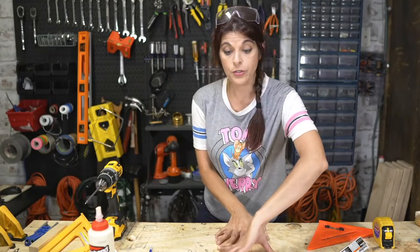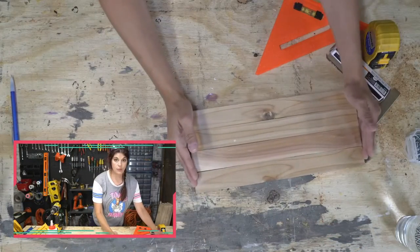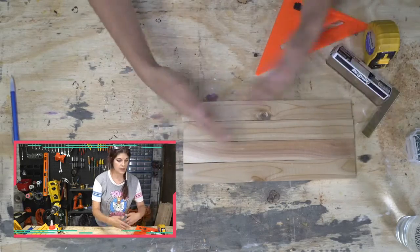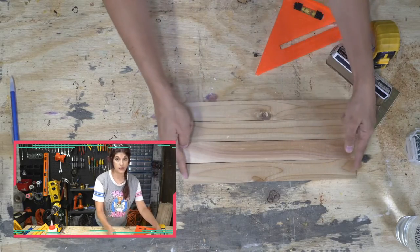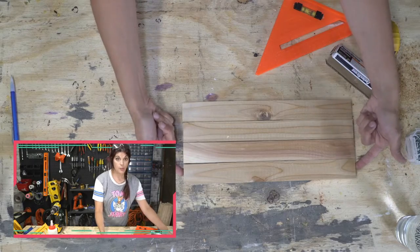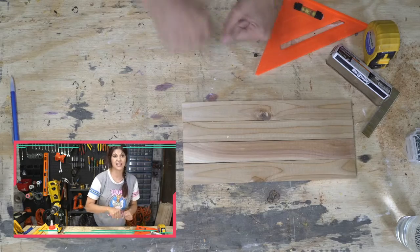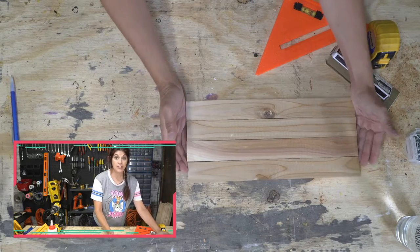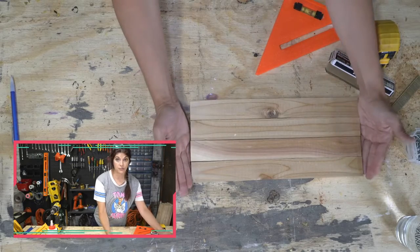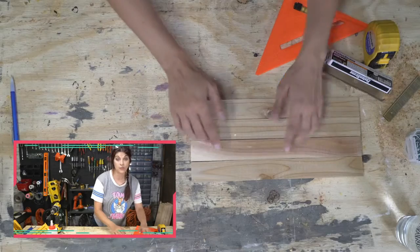So in order to close up that back panel, I basically have the same thing, and rather than go through the whole thing again, I can certainly do this on my own. The only difference is that these are cut a little bit wider, because for drawers, you're going to be pulling them in and out. You want that clearance so it's not rubbing all the time. Because this is a stationary piece, I made sure that it goes flush to the frame, so it really covers up. There are no gaps whatsoever on the side.